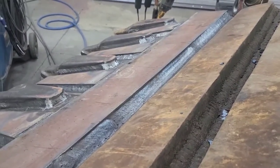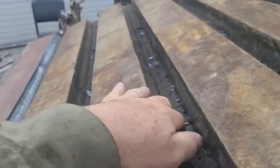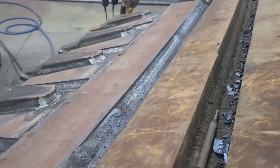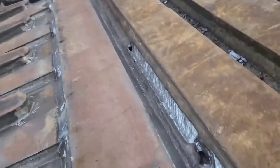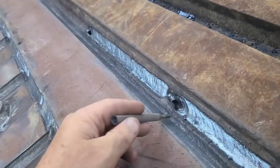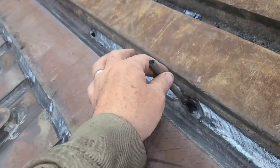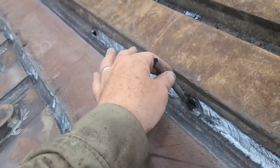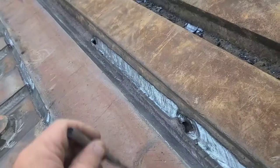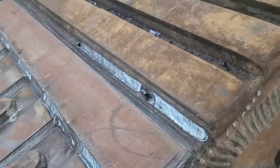And because that happened, we looked earlier where there was a bunch of weld buildup done in between these wear bars. Because that happened when I was welding on my Hardox plate there, I decided to do more welding in this area, and you can see what's happened here. I've blown a few more holes in it. The hole doesn't concern me as much as the fact that there's a little bit of gap here, and that's the reason I think these need plug welded together, so that this backside of the bucket is getting the benefit of the strength of the plate that's inside of the bucket.